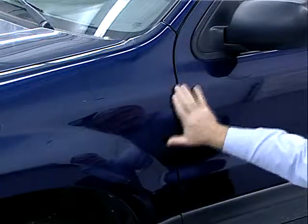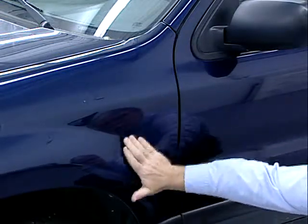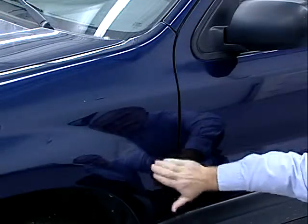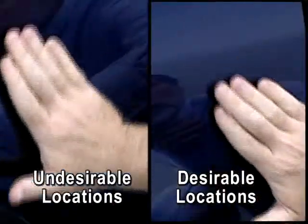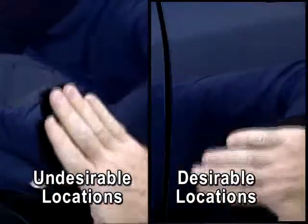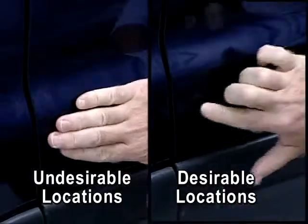To obtain the correct color match, 3 samples are taken to create 1 reading. Begin by selecting an area for reading your samples. Select an area as flat as possible to read with the Acquire RX spectrophotometer. The more the sample area curves, the higher risk of light leakage and the more the light reflection could be distorted. The desired sample locations are adjacent panels to the repair area.